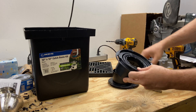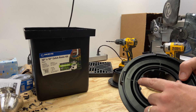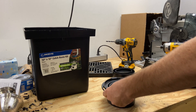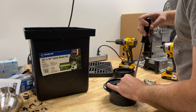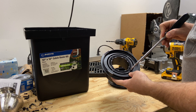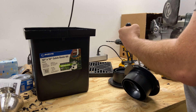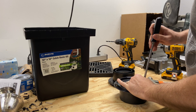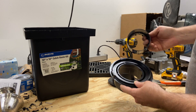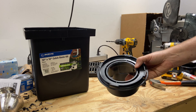It hasn't come out yet — just in front of those knockouts where I put the divot, in front of the arrow, there's another little solid bar. So now we put the screwdriver on top of this little bar and give it a smack again. You'll start to see this thing separate because the little line of plastic holding it on is pretty thin and fragile. With three smacks it's out — sometimes it takes three, sometimes four. That one was pretty easy.